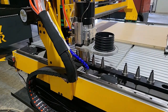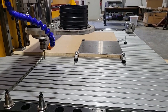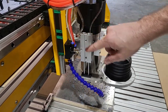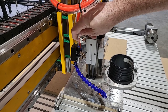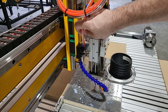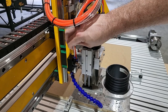We zeroed out all the tools. It's going to pick up our drill first and kick on our coolant mister — you can see we're going to make a mess here. We don't have the bristles on the dust shoe, but we want you to be able to see the action. A little tip: if you want to adjust the mixture, the little line has your coolant and the bigger line has your air — you can adjust the mix ratio there. If you're starting out or the machine has been sitting a while, go ahead and turn the coolant on first and let it charge the line up, because it's going to take a little while to come all the way up. It has a check valve to keep it from draining down, but leave it for a week or so and it's going to drain down eventually.